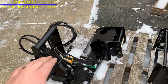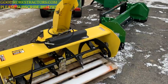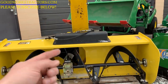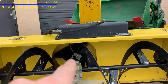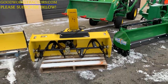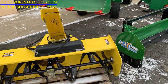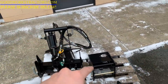The up-and-down cylinder raises and lowers the snow blower to get it off the ground, and you use the loader joystick to control that. This is a two-stage snowblower — whether you have the 47-inch or the 54-inch, both are two-stage. You have a main auger driving the snow up toward the chute, and then another auger inside that shoots it right on out. Typically you're going to see these in the used market in the $2,800 range on the very low end, up to about $3,600 for a nearly new 54-inch variant.